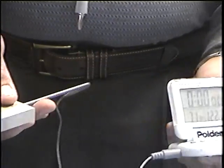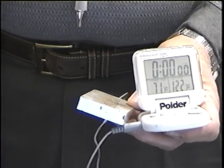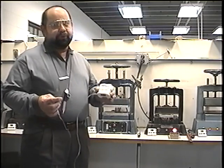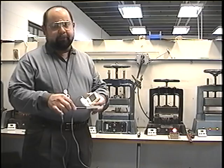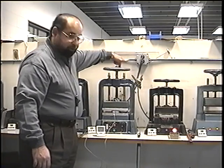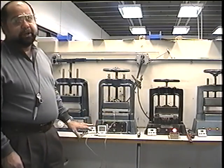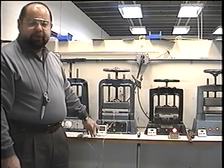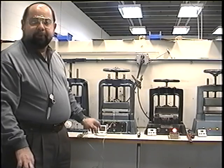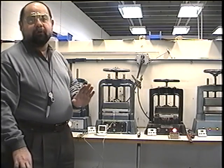And then when you introduce your thermometer inside the metal plate, this metal plate goes to the vulcanizer. So now we want to check the temperature on your vulcanizer. Like we saw before, we introduce the thermometer into the metal plate, and then you put the metal plate in between the plates of the vulcanizer, and press your vulcanizer like you are pressing a rubber mold. When you see it can't go more, you just leave it there until you read your thermometer screen. 310 to 325 Fahrenheit, and within that range is where you should leave your vulcanizer working for 45 minutes to an hour.